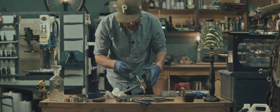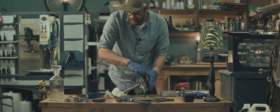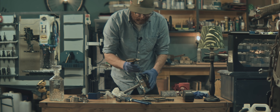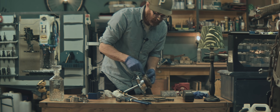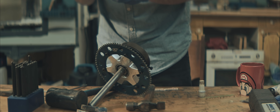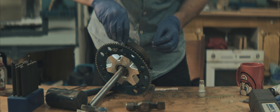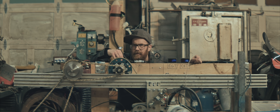I'm always running out of M6 cap heads — I have this extreme consumption. I'll drill and tap those two other holes and I'll be back. The now intentionally seized clutch is back on the dyno. I'm heating up the coolant. Let's hope we can start it and have it idle with the retarder connected all the time, and let's hope we can get some numbers.